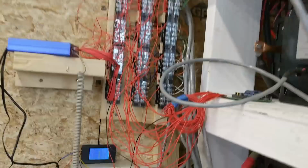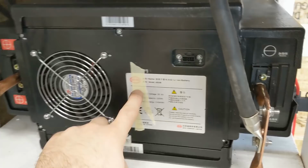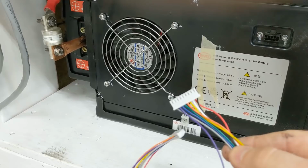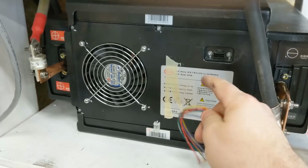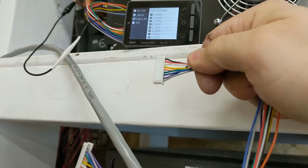By the way, everybody, I really regret having done these Molex plugs. They were really quite a pain. If you do pick up some of these large modules and you want to do it yourself, I would just remove this Molex plug, and get some of these cheap JST-XH 8S connectors with 9 wires on them. You can cut them in half, or you can pick them up as pigtails and just go straight through this hole and wire to those red wires on the inside and just skip this Molex plug. That way this JST connection is the same one that's used on things like this. This is kind of like the standard little plug that I'm finding on a lot of these little devices. So I wish I had just gone straight from this right through the hole and skipped the Molex altogether.